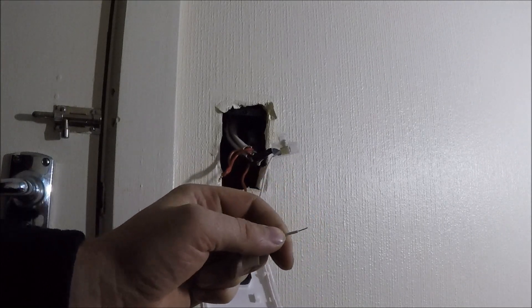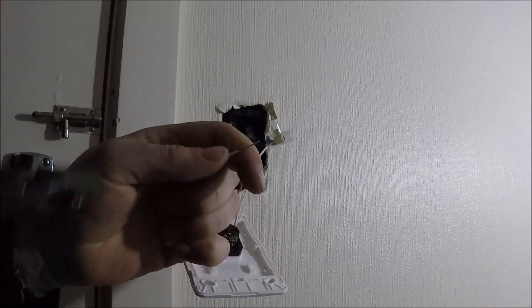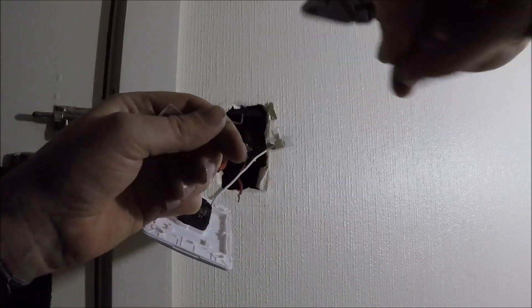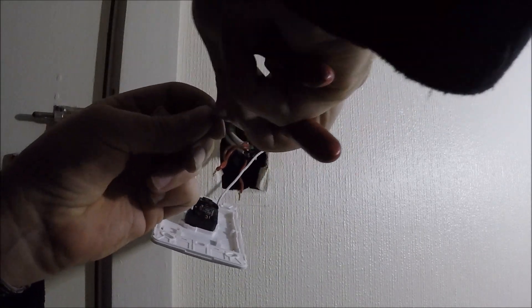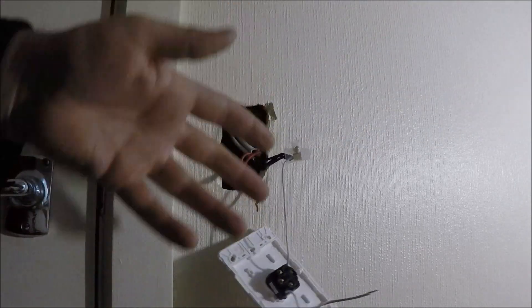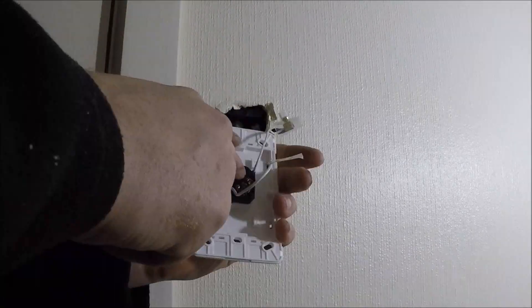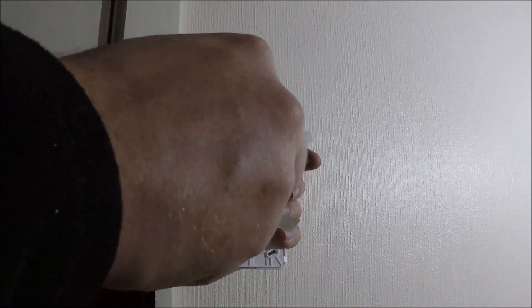Now with this end of the cable, I'll be putting it in the number two, because I want this blue LED ring to operate when the light switch is turned off. In other words, when it's dark at night and I want to see where the switch is on the wall, it will be illuminated. Number two is blanked out — get a screwdriver in there and open up the plastic, then do the old pull test to make sure it's not going to fall out.